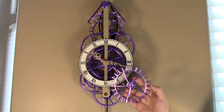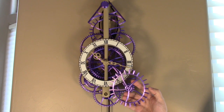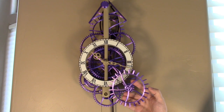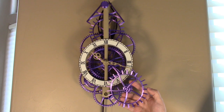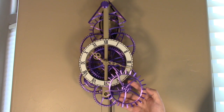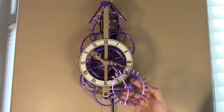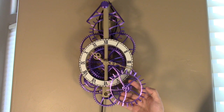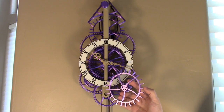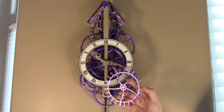This is the escapement style on the new clock. Instead of making pointed teeth, I made the teeth uniform in width and with a sloped surface. The benefit of this is it's very predictable when it's printed — the length, and hence when the escapement ticks, is much more predictable, and it made it much easier to print.